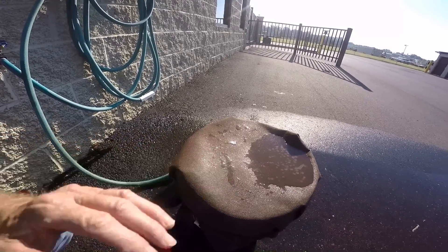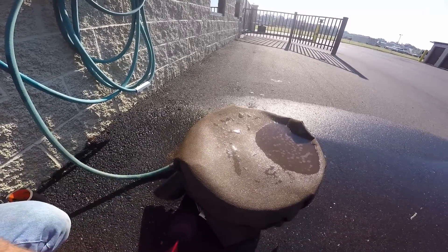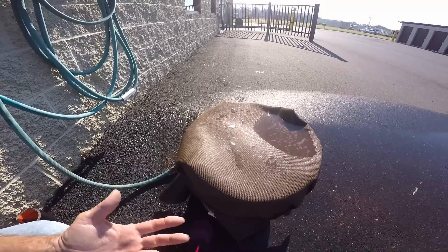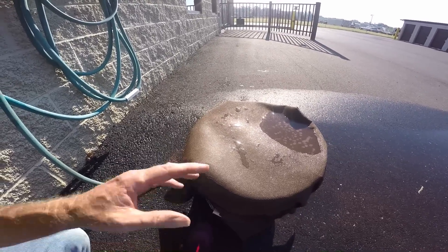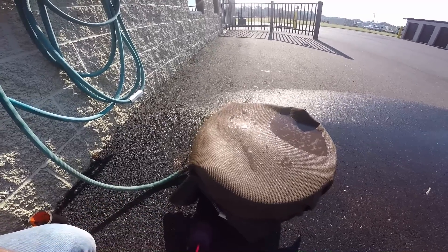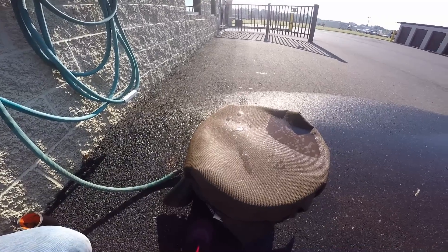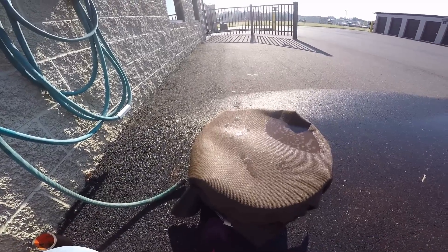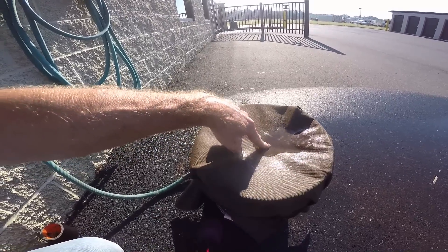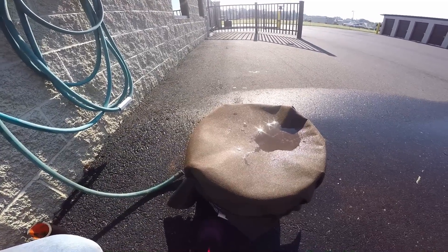It's not long, but long enough. Imagine this covered with clay — sticky clay. This water is just going to run off; it's not going to get into the gravel or the perforated pipe at all. We're talking about a minute or so just to move less than three or four ounces of water. You can see it just sits against the side. Even if I push on it, that water is just sitting there.